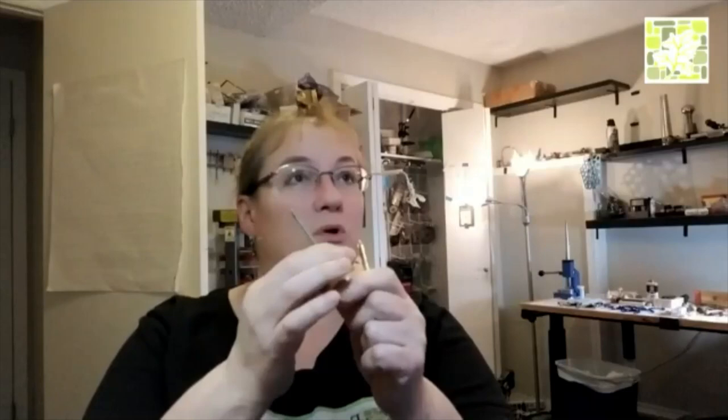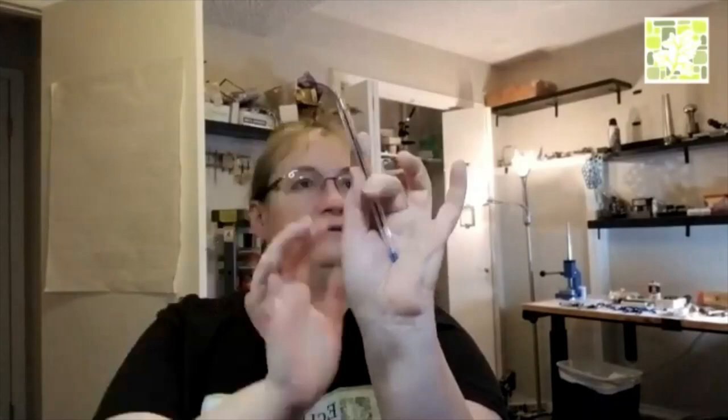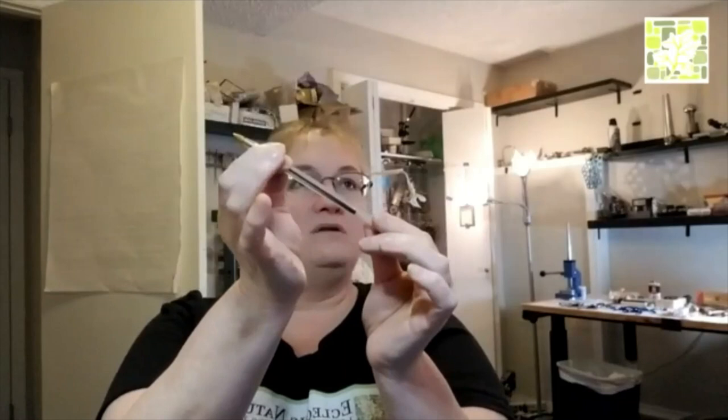He talks about the length on these being between 2.5 and 3 inches usually, but when we get to the section, I think it's chapter 5 on setting your gravers, he talks about sizing hand-related tools like this, where you're often going to be crunching your hand by putting a pen or pencil in the soft palm of your hand and then pinching it together at the top. I'm doing a really bad job of showing you guys this. So you're holding it. That is the distance that you want in total for a well-fitted graver.